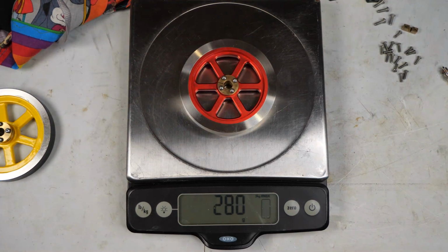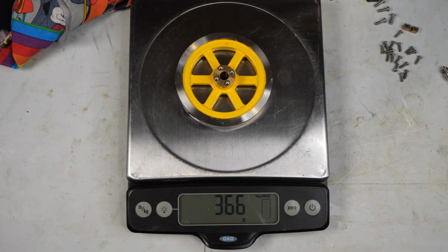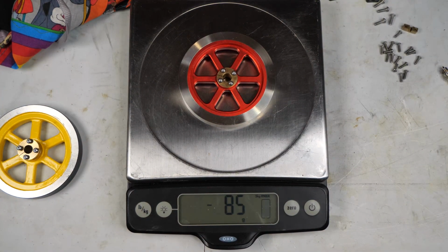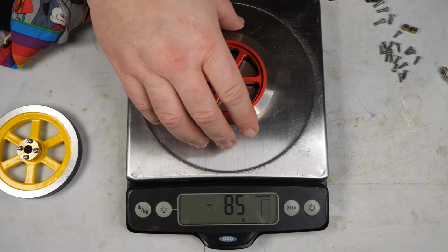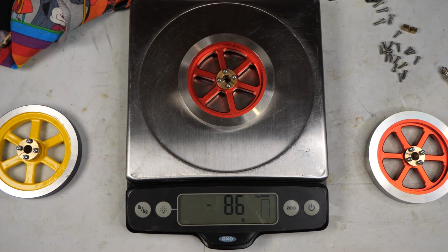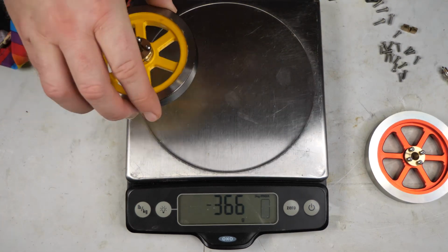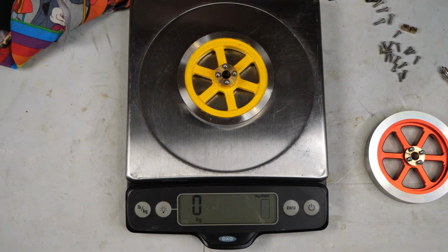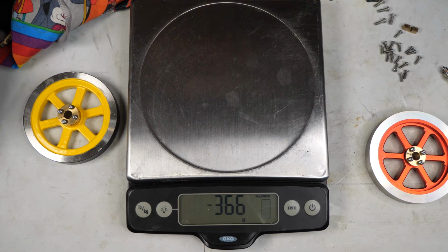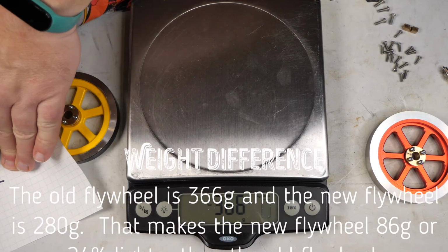The new flywheel is 280 grams and the old one is 366. So the new one is roughly 85 grams lighter than the old one, and I didn't take both the old ones off, but the other new one is 86 grams lighter. So there's, is it, yeah, 366 and 86. I can write this down and do some math to put in the description.